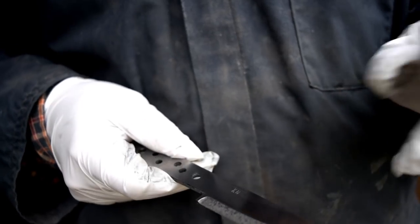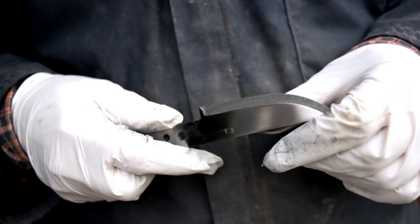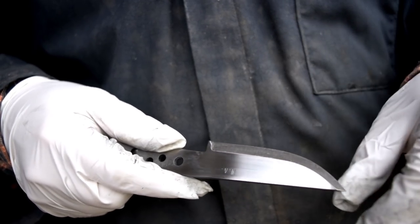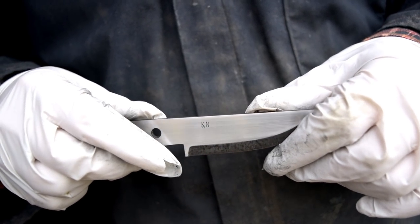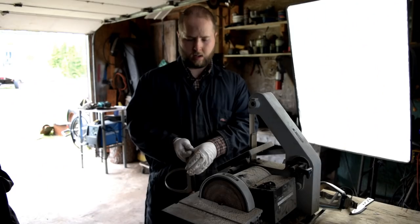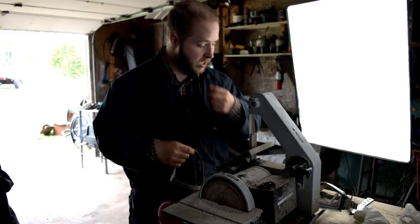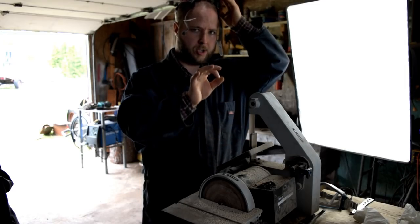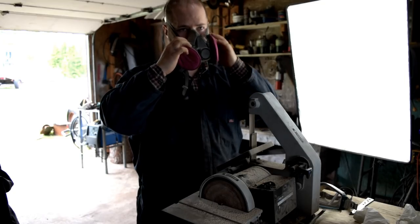Now we have to grind in the bevels. Since I freehand everything, this is the part that's always a little bit scary — you have this nice finish and you'd like to just copy right on top of that, but it gets a little bit tough freehand. You don't mirror up your finish here; you just have to start everything right from scratch again and hope you keep nice clean lines. You guys might be wondering why the 1x30 here — this is one of the belt grinders I started with at the very start. I find that for very finished grinding like this, if I don't have much steel to remove, those little small 1-inch belts give me much more precise control on the bevels. That grinding went successfully up to a 600 grit.